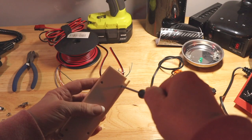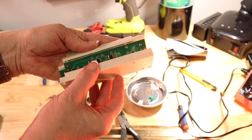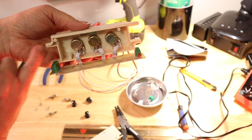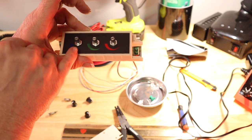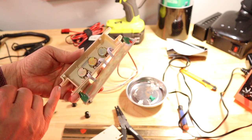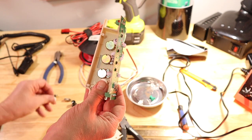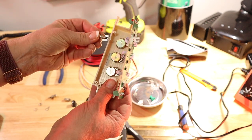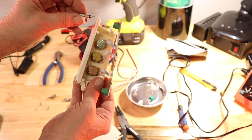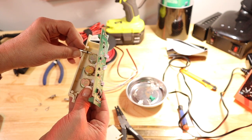So let's go ahead and start with removing the screws on the back of this. Now that I've got the screws out, we're going to crack it open and we see the back of our circuit board. If I pull this down, you can see where our little rheostats are that would turn the RGB just fine for us. And yeah, this box actually has a lot of space in it. So I'm going to drill myself three holes on the inside of here and mount this female RCA plug right through here, situating it so the curved side of the plug is facing up.